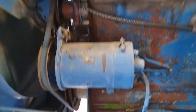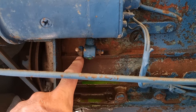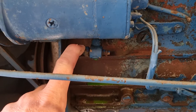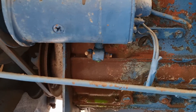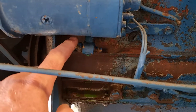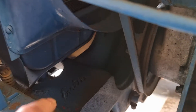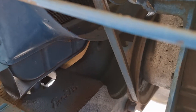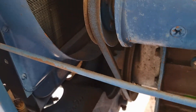To do that, we've got the tap here to drain the coolant out of the engine. You'll be surprised to know that that's actually in the off position — unlike most other valves in the world, when it's facing down it is closed. That's really so if there's any vibration on the tractor, the weight of the handle vibrates down and it's going to be in the off position anyway. Best access is from the bottom — that's the tap to drain the actual radiator, so I took out some coolant that way so nothing leaks everywhere.